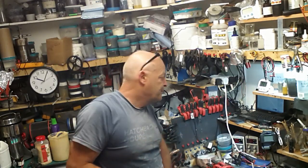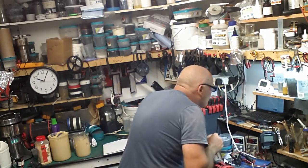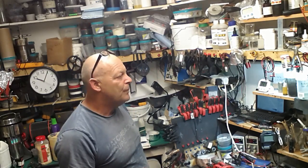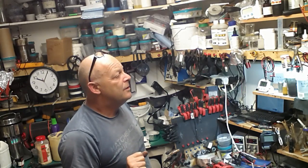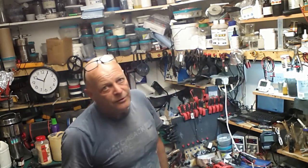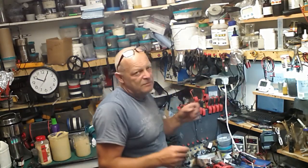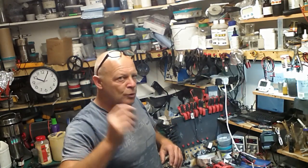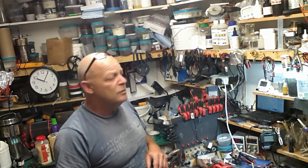I will show the battery, but I'm just going to look at the data logger. Now it's been running for 1 hour and 56 minutes. Don't forget this is 1 gram of material. 1 hour and 56 minutes. And we're on 72 milliwatt hours at the moment. Unfortunately, I made a boo-boo. Normally I cut off at 0.4 now. It was 0.5, it's now 0.4.